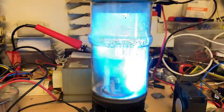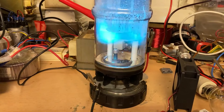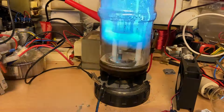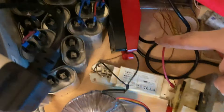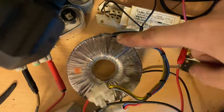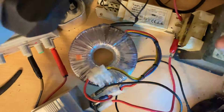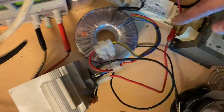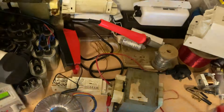Sounds nice — I'd better give it more fan. Very blue. Wind it down. The heating element doesn't glow at all but it is quite warm as you'd expect. To power the exciter, mains comes in, goes through this ballast which limits the current, and then out of that we get about 30 volts — under load probably about 24 volts, which is what it's meant for. That goes into a rectifier, comes out the positive side, goes into this transformer which I'm just using as a choke to give a nice kickback to strike an arc.